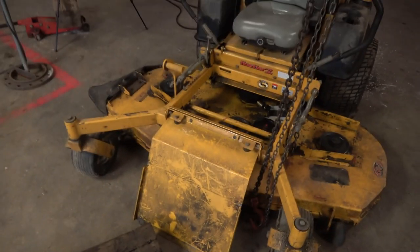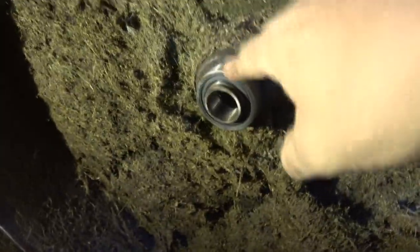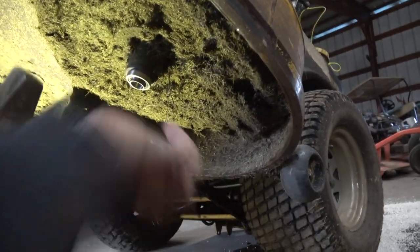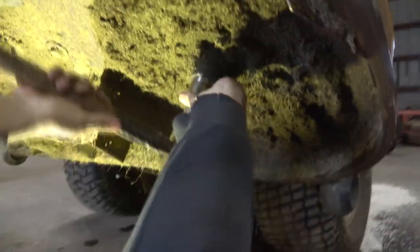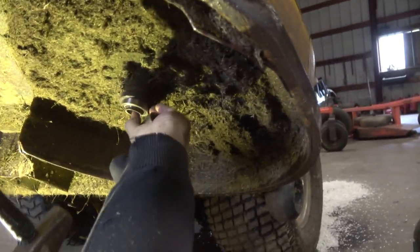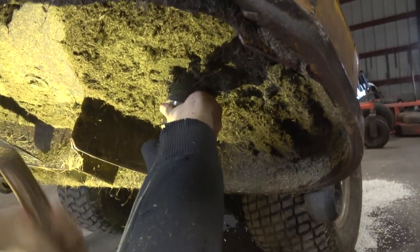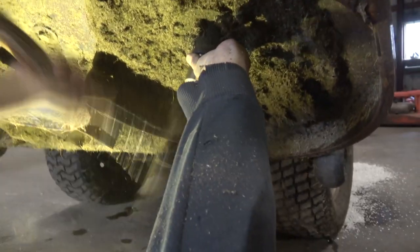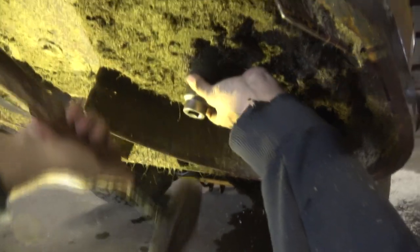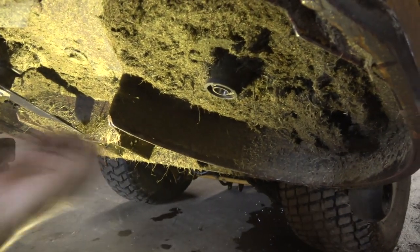So that's what we got, and then we're just going to tap on the outside of this bearing and get it up in there. Try to tap on the outside. Now this socket fits the outside race, so I should be able to drive it in. When you get that up in there, you'll hear the change of sound — when it gets solid, that's telling you you're all the way up in.